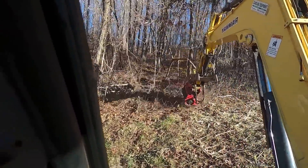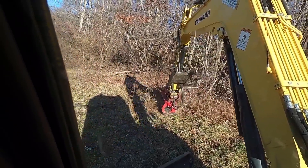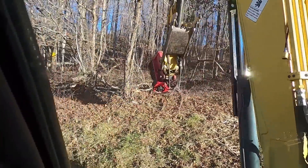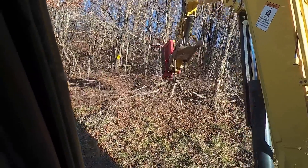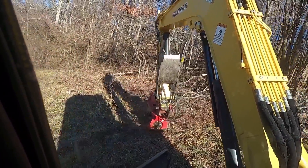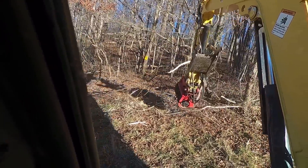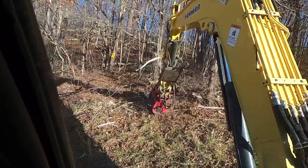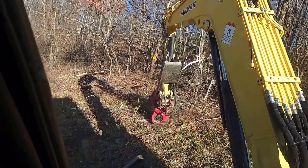It's super handy for doing field sides and roadside mowing on banks. I'm going to try to swing backwards along the same path so you can see the difference it makes — you can turn that head up and drag along. If your teeth get dull it's better to leave something attached just a little bit and then mulch it, but if your teeth are sharp you can cut it however you want. Once it's cut loose the machine can have trouble — it'll just kind of grab and sling it through.